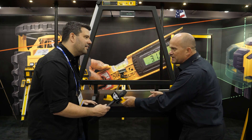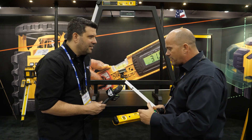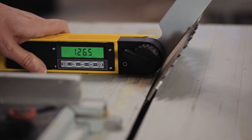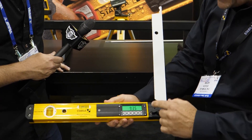Now you scribe your line — it works just like a speed square would. Either way, we could transfer all those angles. It's incredible, it's super fast, and it's accurate. Now let's say we want to set a miter. We're going to cut trim — high-end trim. We don't want to use a lot of putty and fillers. We would check the inside corner, and once we've determined it, we would go ahead and hit this half gauge.